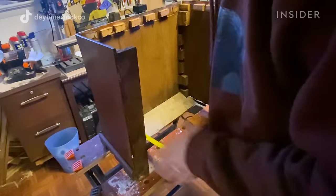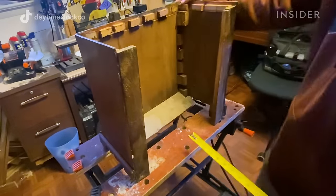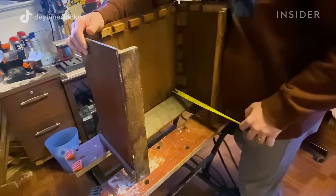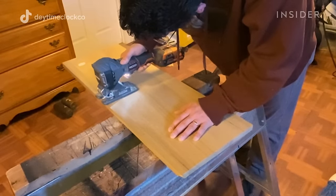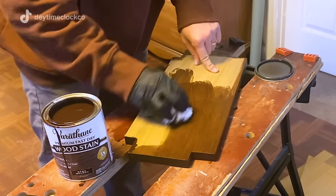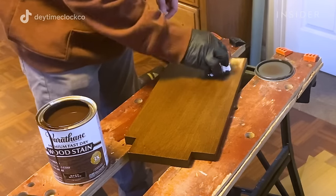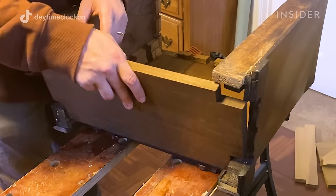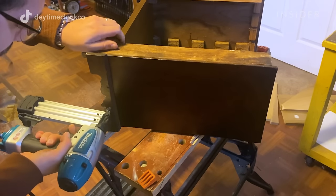The base of the clock is the bottom square section. The floor of the clock was broken and half of it missing, so I just do a couple quick measurements on the inside and cut out a new piece. This is the most common broken thing on grandfather clocks — if there's some type of failure from the weights, they come crashing down, and when you get a 200-year-old clock, chances are it's missing the bottom. I attached the floor to the base using glue and nails, and then the nails just help the glue dry properly.